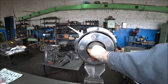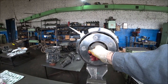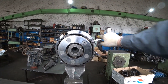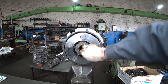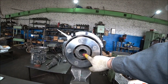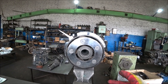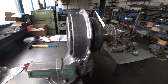Now we're trying to turn this gear — the torque comes from the secondary shaft here. We can see that our marks with the arrow are moving at the same rate — one revolution of the secondary shaft now equals one revolution of the flange. So it turns out to be a direct drive, like on a simple gearbox such as the 6S-90, which goes without a demultiplier — like extending a solid shaft further.